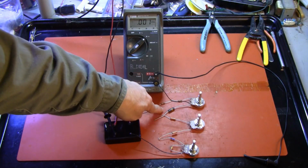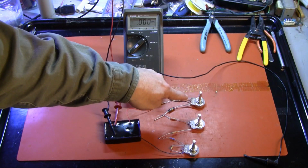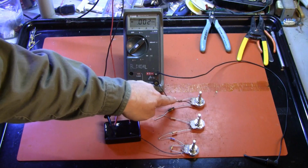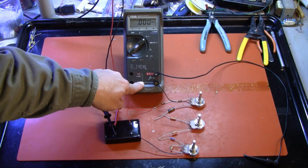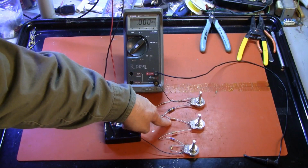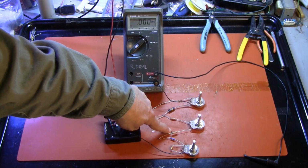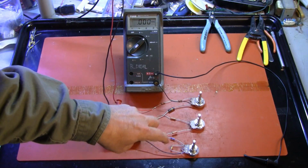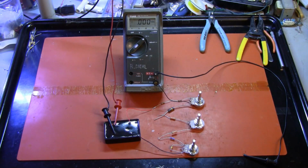Now, continuing, let me just go through the parts and point them out. Here's the 3K resistor, the 47K resistor, the 100K shading control, which controls the collector electrode, the ground tap that was shown on the schematic as ground is the meter ground. From there is our 620K in series with a 33K, the 100K focus control, the next 33K, a 220K, and the 50K beam control, and back to the power supply. That is our loop.